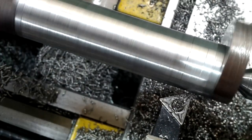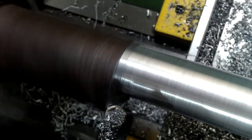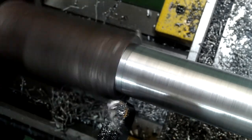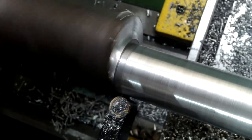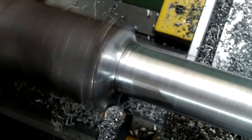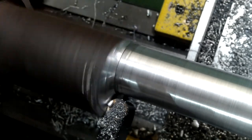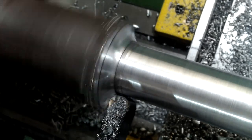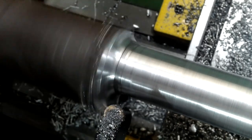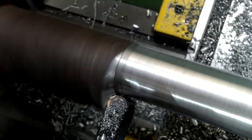To put a 5mm rad fillet between the two parts of the stub shaft, I used a 10mm button tool. It's got a very positive rake angle. I did this as a test cut to see if the machine could handle it. It did cope with it, but to be honest, I did have a couple of jam-ups during this test, only to find that it was the fault of the drive belt, it was a bit too slack. So after resetting the drive belt, it was all go.